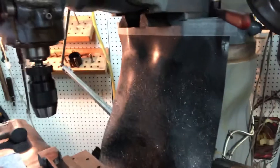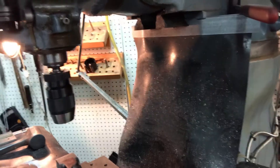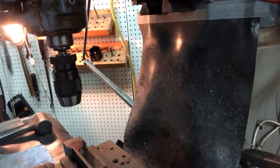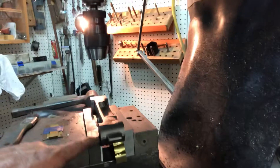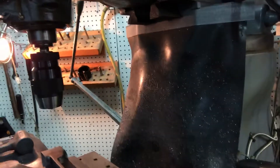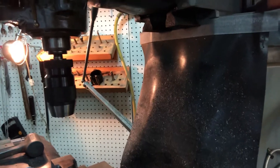Here I've got the drilling head set up. I've center-punched the marks where the cotters will go, so I'll drill both of those a quarter inch through, countersink, and drill through. I've marked which side gets the quarter inch only hole and which gets the half inch. This one is also narrower on this end, so I've got a brass shim underneath to hold it level. You can see the center dots for the center line, and it's fairly level and securely fastened. A casting doesn't need to be perfectly perpendicular — it's awfully close right now.